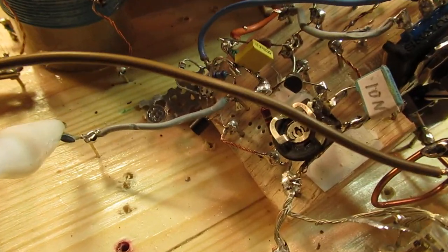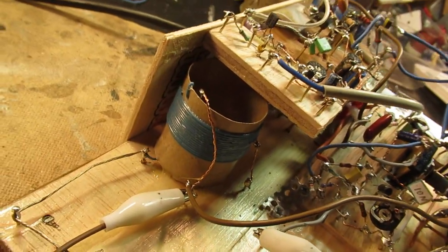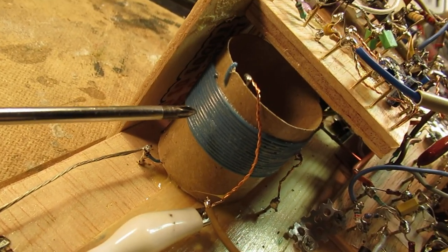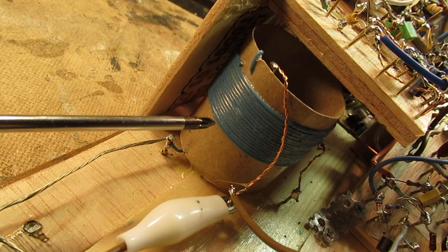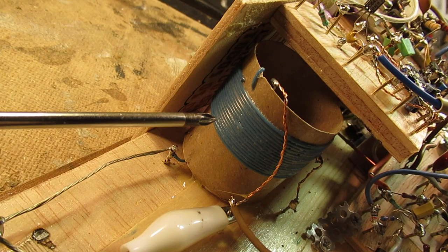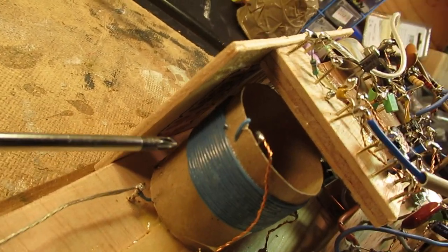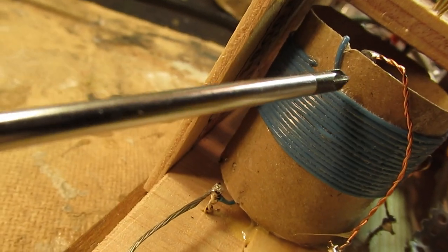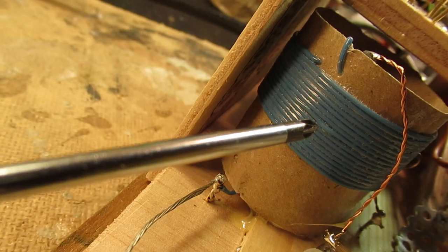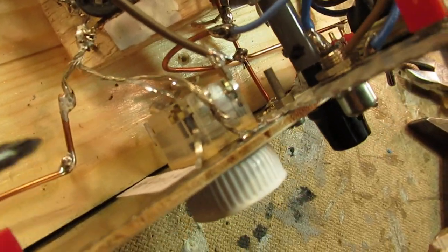Everything, and really everything, is related to the properties of the coil. And then I mean the inductance, the stray capacitance, the normal capacitance, etc., etc. Of course, we know that between all these windings there is a natural capacitance that bridges, for instance, this tuning capacitor.